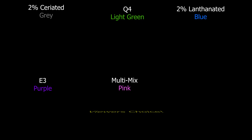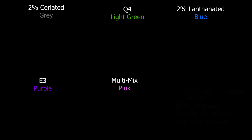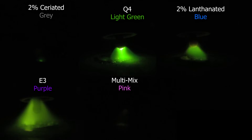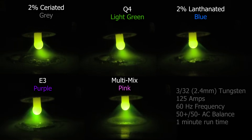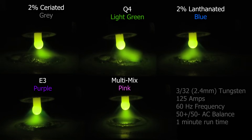Get ready because this one is going to be left up to you. I know I did all of the review and analyzing, so now it's your turn. We're going to fire these up in slow motion, and you're going to be the one who tells me which one is the best one. Very interesting. Up top here you're going to see a poll — that's for you to vote on which one you think is the best arc start. You can also comment below. So here's what we need to look at: stability of the arc, direction of the arc, focus of the arc. Maybe we'll pay attention to some of the burn back, some of the fluttering, some of the quivering. I can see there's a couple issues with the gray, with the green, blue — purple's pretty good — pink's pretty much solid. So we're just going to run these ones out and you can tell me which one you think is the best.